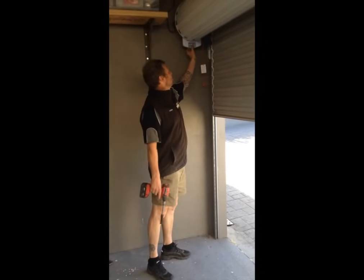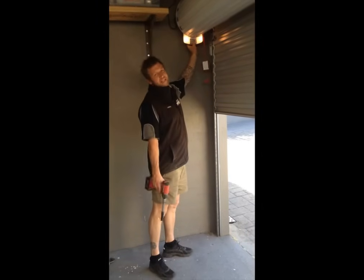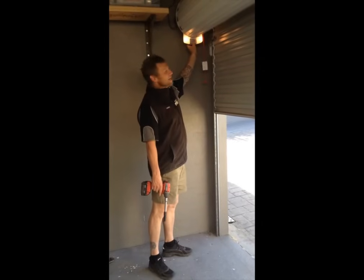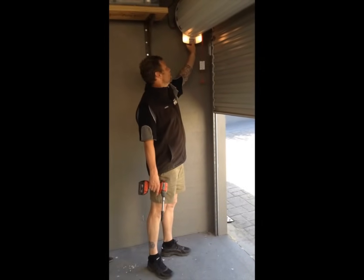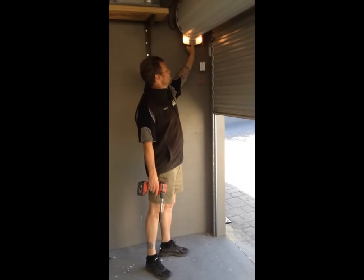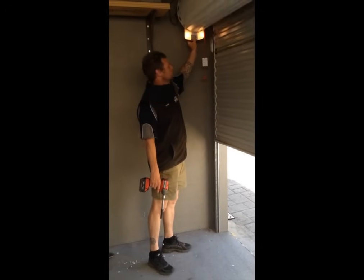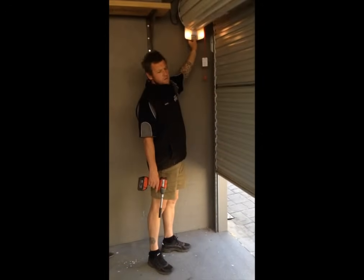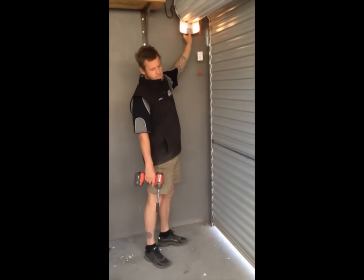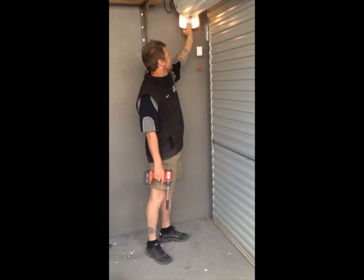So what you want to do is hold down the close button. This is for the ATA GD06 — hold for 6 seconds until the close limit starts flashing. You'll hear it start to beep. Then just run the door down until it just touches the ground, not too hard. You can stop it before and just inch it down — there we go, just touches the ground nicely. Press set.